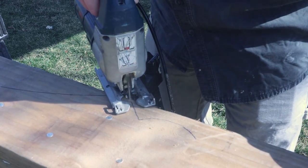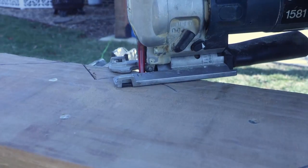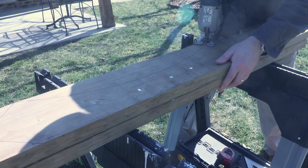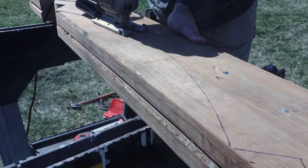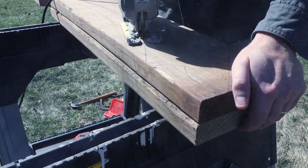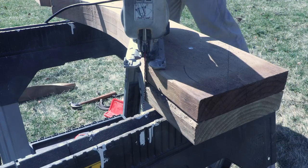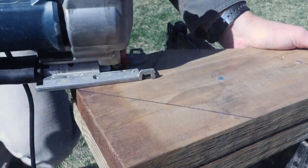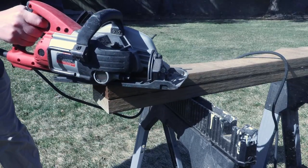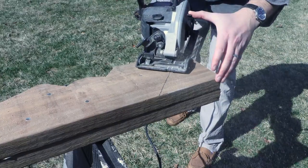You will find that making relief cuts makes the process a little easier. As you can see, if you have a nice sharp blade and a steady hand, the cut really shouldn't need any sanding at all. Once the pattern is cut out, use your circular saw to cut the miters on the ends of the boards. Since your saw blade won't cut a full 3-inch depth, finish the cut with your jigsaw. If you have a miter saw, that will make this step easier.